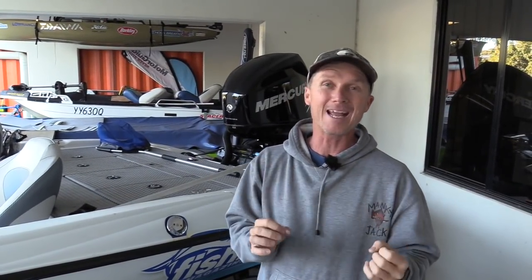The next thing I wanted to do was get rid of the carpet in the Bass Boat. We use our Bass Boats in salt water a lot, and salt water getting stuck in the carpet with the stainless steel and aluminium hinges is really not a good combination — we get electrolysis, a lot of corrosion. I've also found that when it rains, those decks get very heavy with the carpet on there. I reckon it holds 20 or 30 kilograms of water every time it rains.